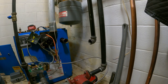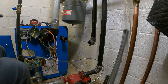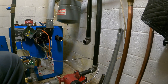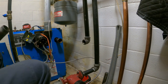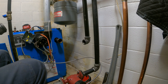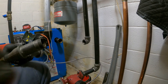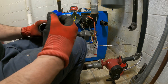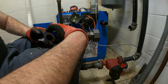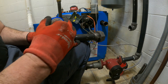Now I just got to reconnect to the boiler — this I just had to fix something real fast and I needed a little change. Let's see what I can do with what's left on this roll. This white stuff's fine right here. So here we go, we're going to wrap this up with some Teflon so I can put all this back on. Finger inside and roll with your pipe.